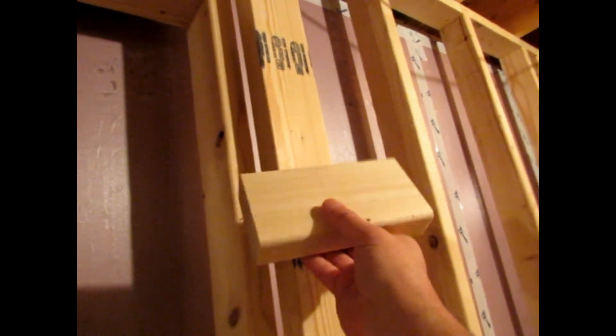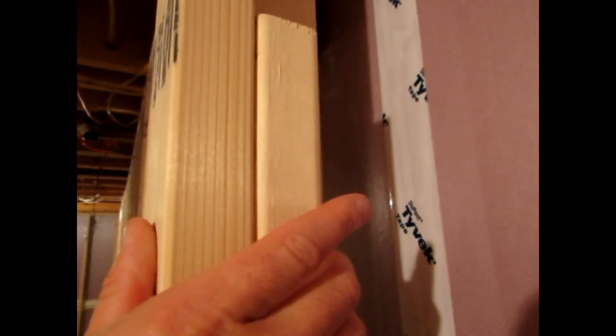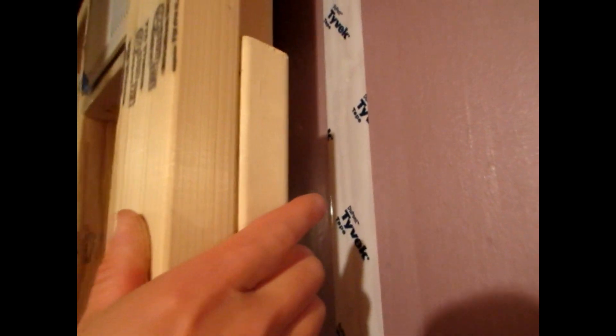With one set of hands, and assuming it's going to be relatively in line with this other stud that I've got here — that's the way I laid it out — I'm going to use this piece of blocking, tack it on the back of my stud here, and that's going to give me a nice tight secure corner. The benefit of that is it allows me to fasten this really nicely, gives me a strong corner, and on the other side it gives me a place to fasten my other stud where I've got to finish off my drywall.